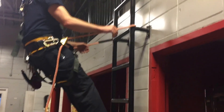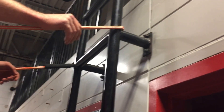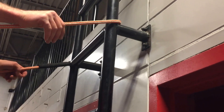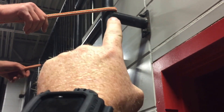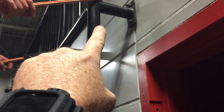If this doesn't work — the problem with this type of setup is that he's run his device around both beams. In this case, we've got a piece of structural steel right here that will catch him in the event that he were to fall. But if that isn't here, if he was rigged right below it, he would have to slide all the way down to the next support before it would catch him.